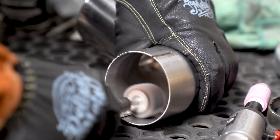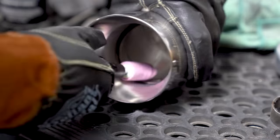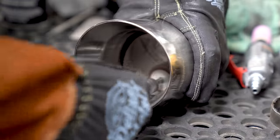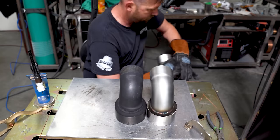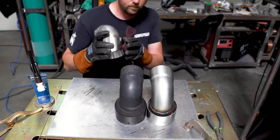Cleanup for these parts is done with an 80 grit flap wheel on the end of an air grinder. On the inner lips and weld beads popping through on the inside, I smoothed it out and chased it with a stone wheel before smoothing again with a flap drum. The final finish on the outside was a light brush look with a red surface prep pad. I went with the brushed look because it could either be fully polished or coated at that point, but it's uniform just in case the customer wants to leave it as is.